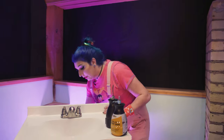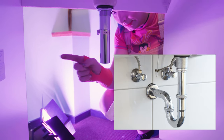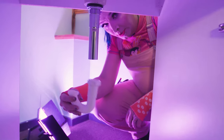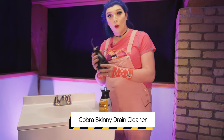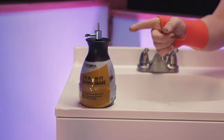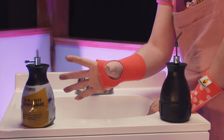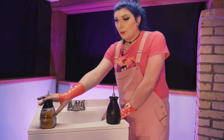If the clog isn't fixed, we're going to look underneath at the P-trap. The P-trap can be taken off, and there will be another connecting pipe that goes right to your drain line — you can snake it right from there. You don't need to remove the stopper to snake your drain. This is called a skinny drain cleaner, or a Cobra skinny drain cleaner. These are about ten to twelve dollars, available at most hardware stores including Amazon. They're very user-friendly, low cost, and only ten feet long — enough to handle most things but not so long you get into serious trouble. If this doesn't work, I'd recommend asking a plumber for help.